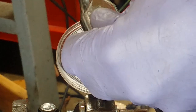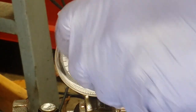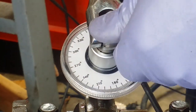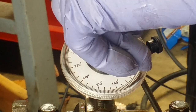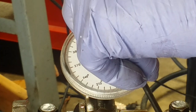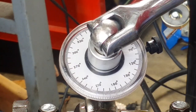According to the instructions, I now have to turn this to 70 degrees. Let's double check it — put it on zero again. Now I'm using a breaker bar, because I think it was Archimedes that said give me a lever and I'll move the world. The longer the lever, the easier it is. I tried this with a half-inch ratchet and it did not go too well. At 70 degrees — just pull the dial and it's moving smoothly — stop at 70, and that torque is done.